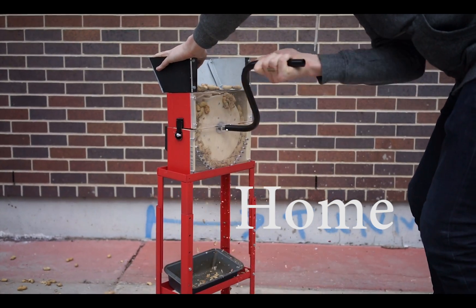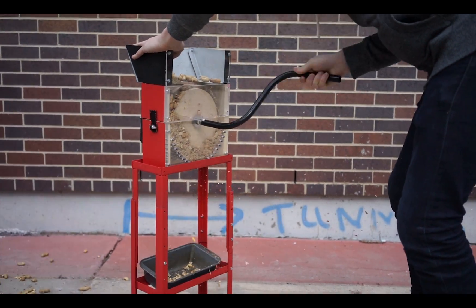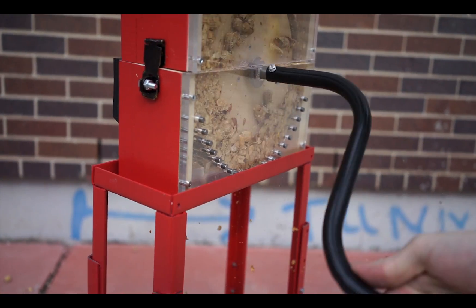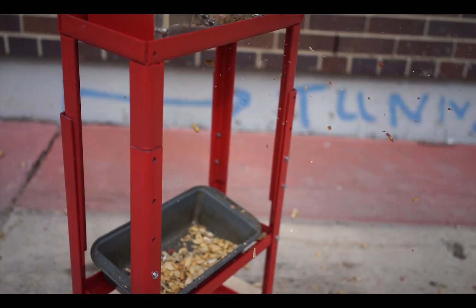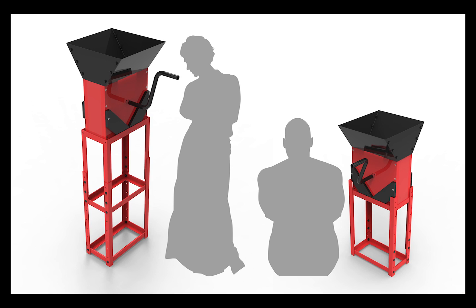When going back home, I took what I learned from Africa and applied it to my final design. In this model, part of it is in clear plexi so you can actually see what's going on. Peanuts are shelled by the wooden wheel rubbing the peanuts against each other and the pin system, which releases the peanut from the shell. It is important to use a wooden wheel and not a metal wheel because a metal wheel can rust and ultimately get metal shards into the peanuts. My design also incorporates an adjustable stand to allow people with disabilities who might be shorter or taller to use the device as well.